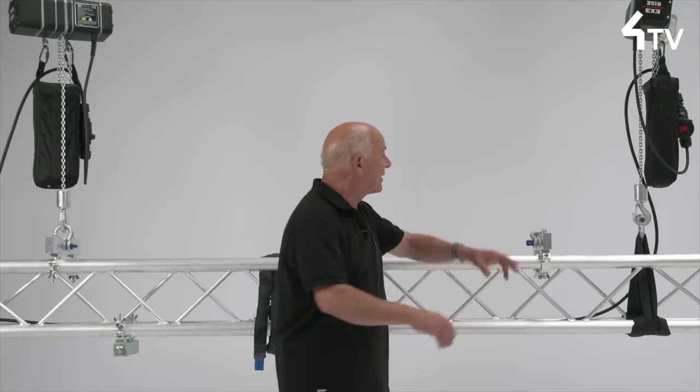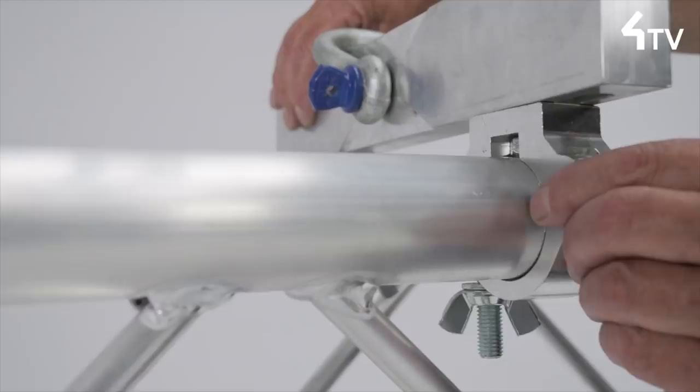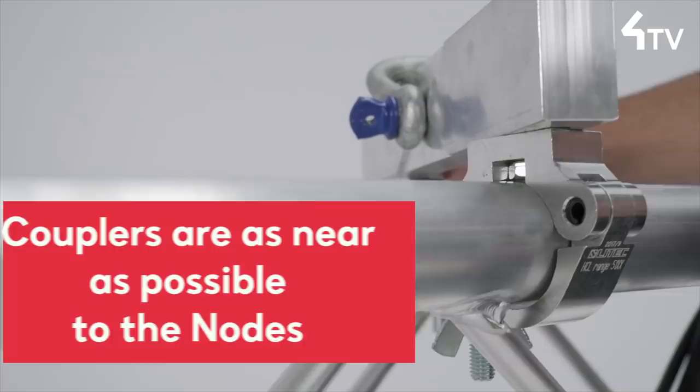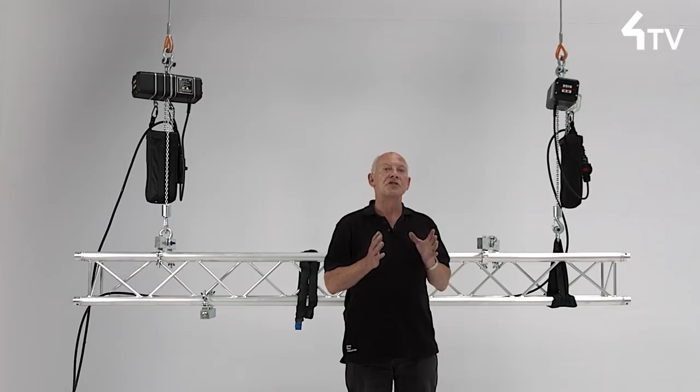It can be slid and shuffled so that the couplers are as near as possible to the nodes. This adjustability also allows for slightly unevenly loaded small trusses to be picked up at their centres of gravity so that they will hang true, that is, with the sides vertical.